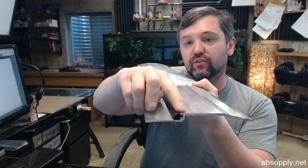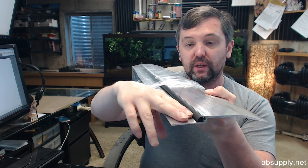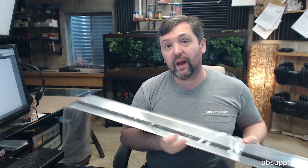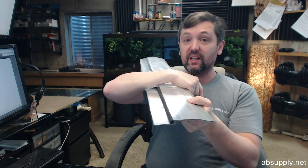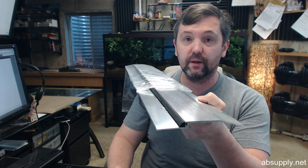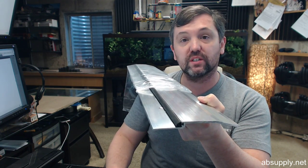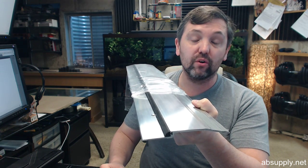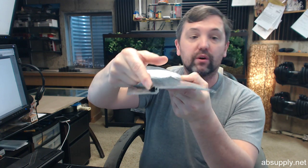So then you've got 3/8 from the top of the threshold to where the portion would reside underneath the door. Now, if you have a typical hollow metal door, a 1/2 of an inch overall height is probably going to be too short, because hollow metal doors have a typical undercut of 3/4. But it's very likely that you have a condition that your undercut's no longer 3/4 because maybe the flooring condition has changed, or the concrete is not exactly level or flat, or maybe it's higher than it was anticipated originally to be, or you simply have a longer door and you'll never fit something taller underneath there. You need that 1/8 of an inch margin down here and a 1/2 inch overall height to where your door, let's say, is 3/8 of an inch above your concrete. You'd be able to sneak that in there very well and have that work quite effectively for you.